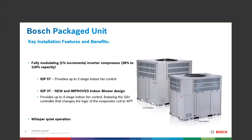On the IDP 3-ton, we can also diminish the logic of SW44, which is our temperature logic. We can go from a 47-degree coil to a 42-degree coil. But if we use the dehum mode, that 47 goes to 45 and that 42 goes to a 40-degree coil, allowing a differential of two degrees while slowing the fan down to its lowest denominator to be in dehumidification mode.